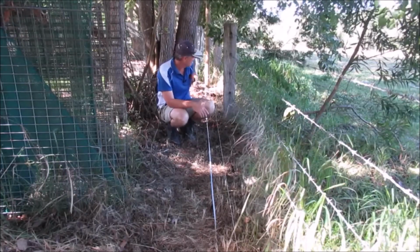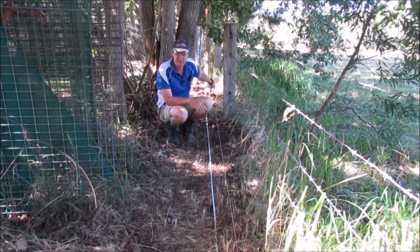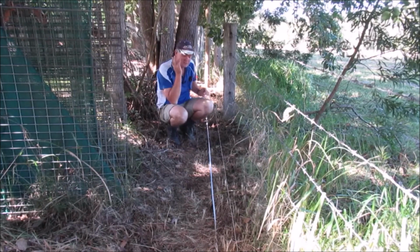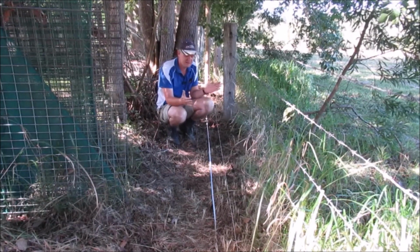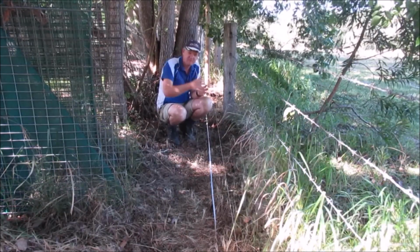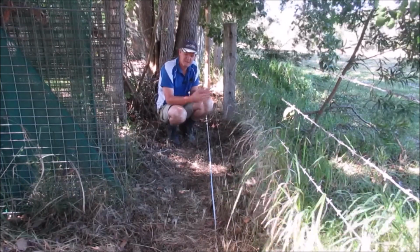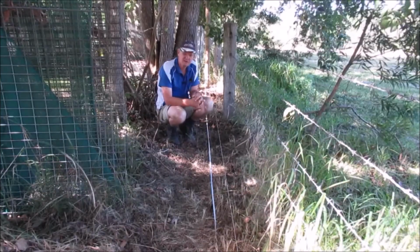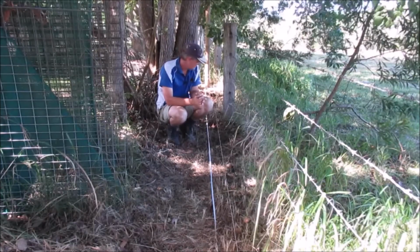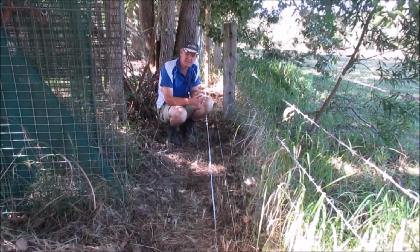And it's like a 600-800 mil round tree trunk. So I'm concerned that if I'm digging right at 2.4 there, that I'm going to be right into the roots of it, and it's going to be very difficult. The first post behind me, I'm going to shrink that up a little bit and then that will change the spacing for the rest, but I'll get them closer to 2 meters, 2.4 meters, something like that, for the rest of them. Just this first one, I'll just shrink it a bit just to stay away from the tree roots the best I can, and we'll go from there. So I'll mark out some dots on this string line and we'll start digging and see how we go.